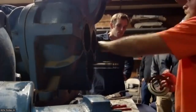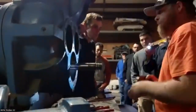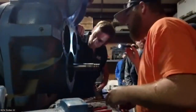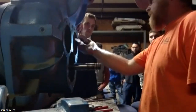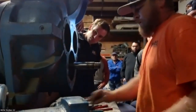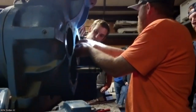Push your balance piston. Leave right here, this clearance is what that seal sits right on. When we get these in, we're usually inspecting them for galling. Yeah, I got it. Got a pretty big ding in it. Not uncommon. It's not terrible again. Parts that are normally replaced. So this, it is removable. There's a grub screw right here. At this point, I normally don't remove it. We're getting that grub screw out, the rotor's in the way. I usually wait till the head's off. You can remove it right now. It's not terribly hard. It's just a grub, the anti-rotation.